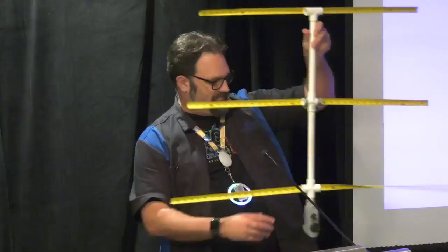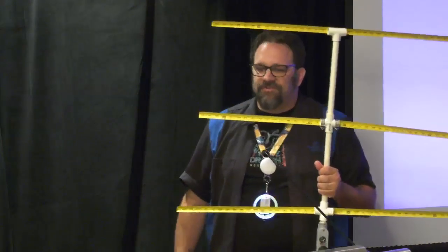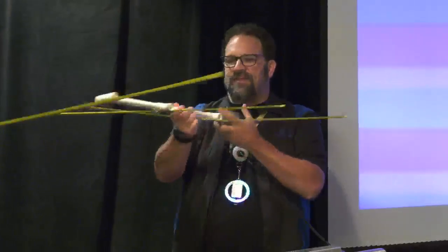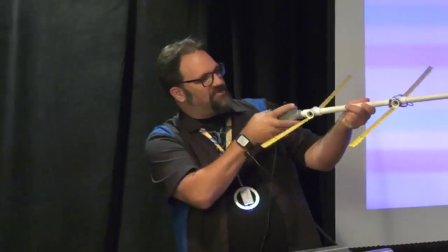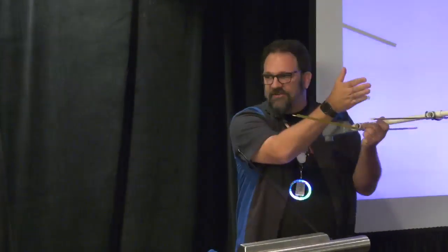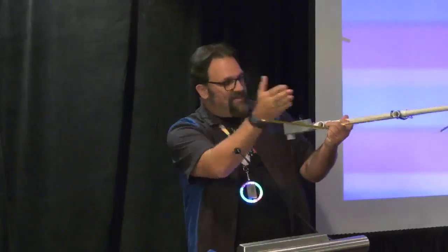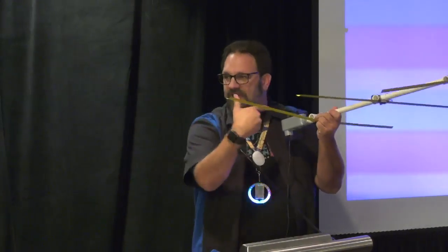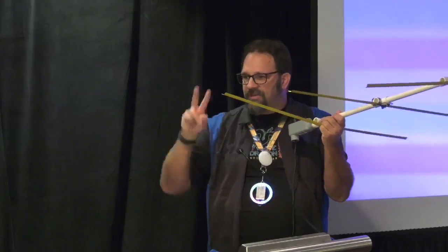But first, one of the other ways you can figure out where a transmitter is, not just by signal strength based on where you are location-wise, but by using a directional antenna. We all know what Yagis are, directional antennas. You can kind of think of this antenna as an arrow. The signals that come in or transmit down the beam will be much stronger. It's focusing the signal intensity, so you can think of it like a lens. A lot of the energy coming down that beam will be very strong, but any of the energy coming in the side will be very weak.